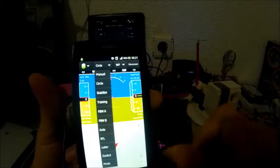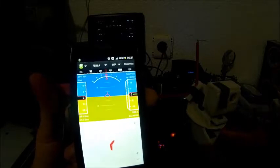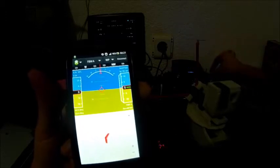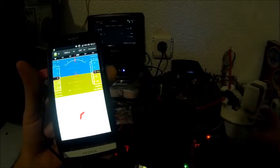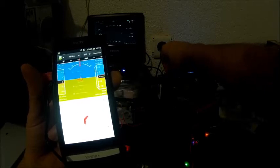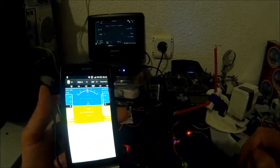Alright — let's go ahead and try another mode like Fly-by-Wire-A; it changes there also. Another thing I've done is programmed the flight modes on my transmitter as well. This switch I've assigned to Manual, Stabilize — the other switches for Auto mode — then Circle as you can see changes on the screen also. Return to Launch, Return to Home, Stabilize. So guys, that will be all. I thank you very much for watching and see you next time.